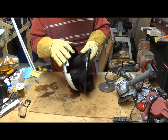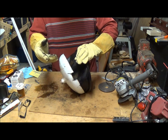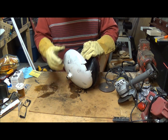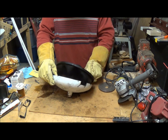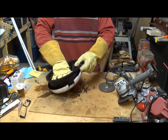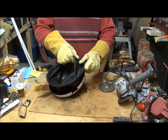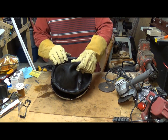I can't think of a way to keep the other one from getting damaged. I do see a bunch of rust right here on this side, but that could be because this thing was sitting on its side. So, whenever you push air into this, it's basically folding the bladder this way, and then as the water fills up it fills up this bladder. So I was wrong — it's not an air bladder per se, it's a water bladder.